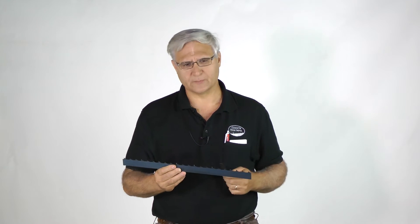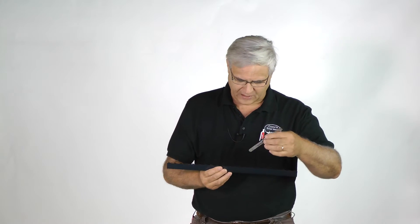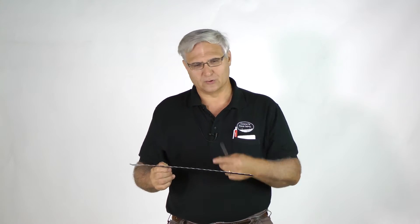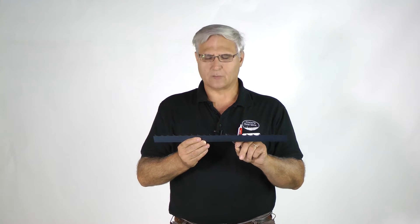What that does with the blade is, as you're sawing, the more hook angle you get, the more it will tend to pull the blade into the cut. There was even a company that built a mill that would pull itself along — they did that by the hook angle, moving one side of the carriage, which affects how the hook angle enters the cut. The more you tilt that down, the more aggressive the saw blade is.